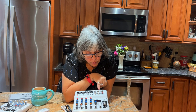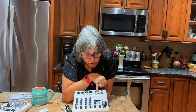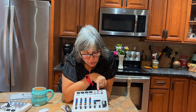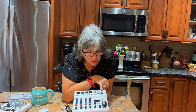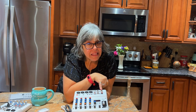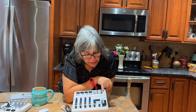You have your main out left and right, so if you want to plug this into stereo speakers you could do left and right. If you just have a single amplifier, put it in the left one. This is your headphone jack — it's a quarter-inch phone jack, so if you only have an eighth-inch plug you'll need an adapter, which they sell.